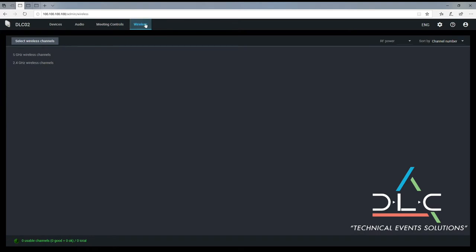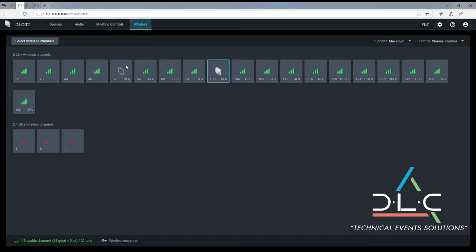The wireless page allows you to see which channels the system is using. You don't normally need to touch this, as it manages the spectrum efficiently without any intervention, using one channel as the main frequency whilst holding a backup channel ready in case of any interference on the primary channel. If you do need to avoid certain frequencies, it is possible to deselect any that are not available to use. The APT prefers DFS channels, which due to the rules of use that must be adhered to are generally free from other commercial Wi-Fi products, meaning less chance of interference.